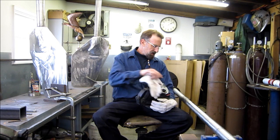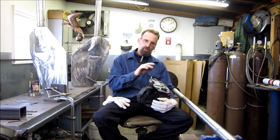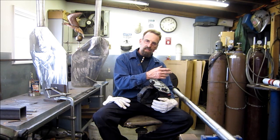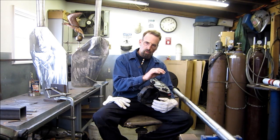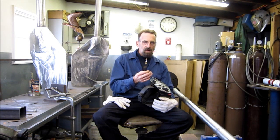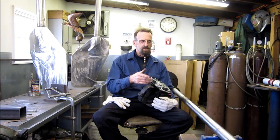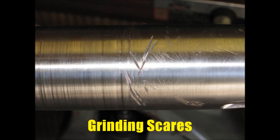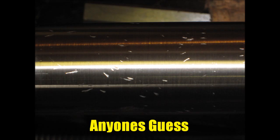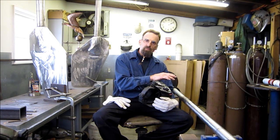I've completed the welding on here. After I stick-welded it across there — two passes — and cleaned it up, I made sure by going around each end with a heli-arc and sealed and rolled it in, because you can't have any undercut coming from your weld onto the shaft. Otherwise it becomes a hollow, a dent, or a divot, and there are plenty of those put in with pipe wrenches, hammers, and all kinds of things. We're shooting for the best quality.